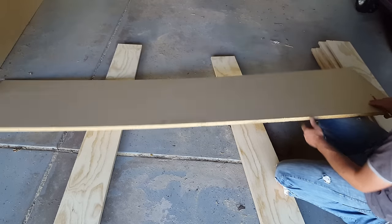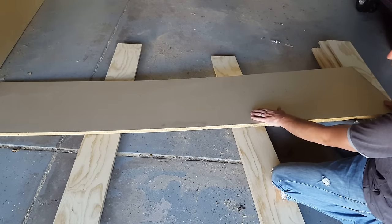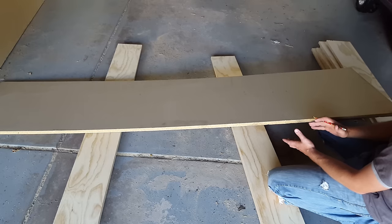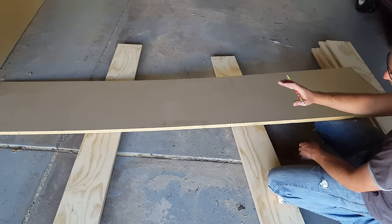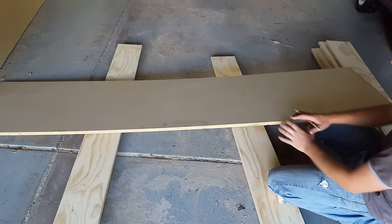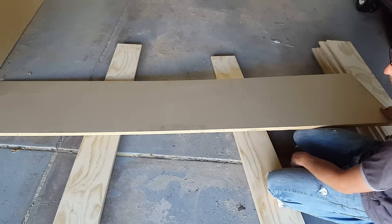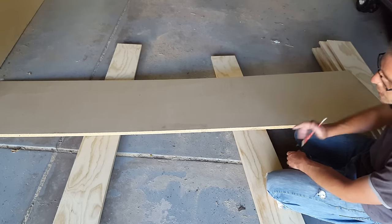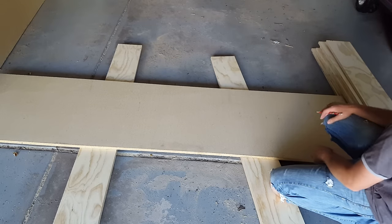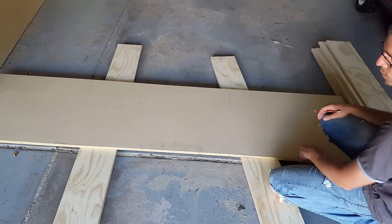I chose particle board for this project — particle board, I know. Never liked using this kind of wood, or if you can call it wood. It's basically glued together sawdust. But I did a few tests at the lumber yard and this seems to be the one that doesn't bow as much over a long distance. I talked with a few guys there and they agreed it was a little bit better than MDF. The only issue is the edge here is not so pretty, but I'm going to fix that up. I'm going to be painting over this and paint does very well on this type of wood. I'm using three-quarter inch — I want this to be able to hold up to anything for the pantry shelves.